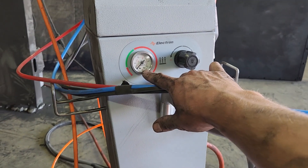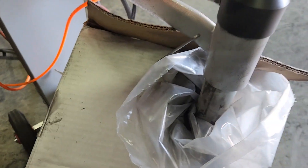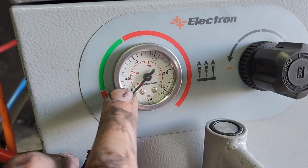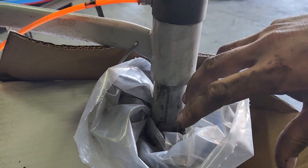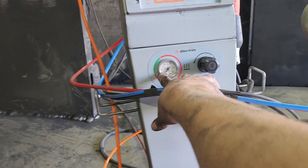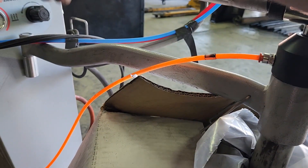The last thing I want to mention is the fluidizing air. In our second video on this gun, I think we talked about this a little bit. When you're fluidizing, you can look in the bag and watch it bubble. We noticed that if we cranked it up to 0.5 bar, we were having a lot of powder come out of the bag. We actually have this thing zip-tied around the pickup tube — not super tight because you've got to let a little air out or you'll blow up the bag, but tight enough to keep most of the powder down in there. So we're running it down in the red, probably two bars below that 0.5. Just play with it — the dial is real easy. You can pull the trigger, get it vibrating, get the air going, and then adjust the dial. It doesn't activate until you pull the trigger though.